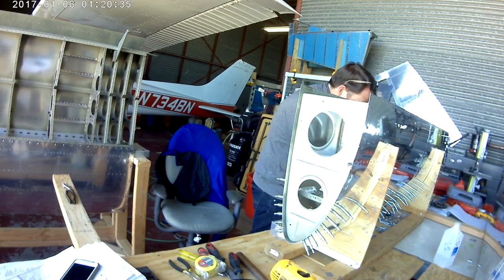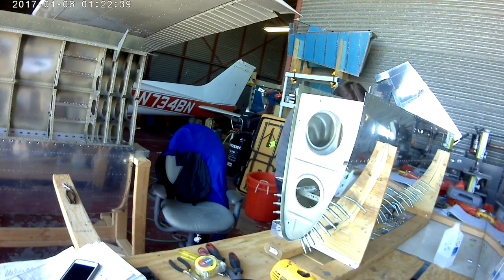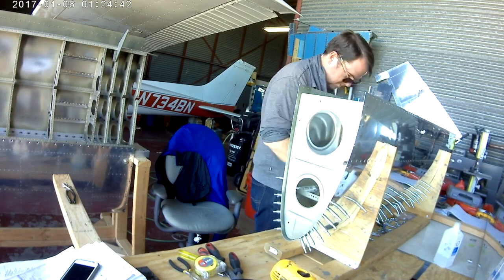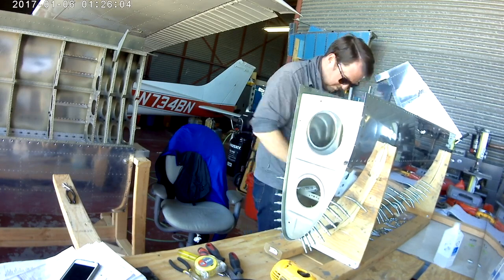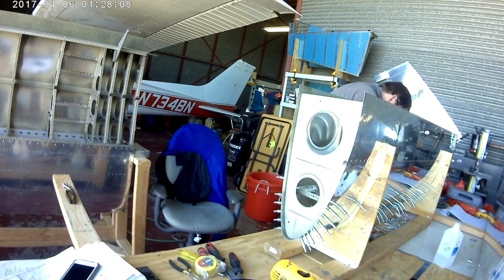Well, that's great. Other thing is, make sure your mushroom set on your rivet gun is flush. It's not as easy when you're working by yourself, so you have to be very vigilant, because you don't want to leave any scars or things that you're going to have to fill with Bondo later. Which I think I've already left one, but, you know, big deal. Anyway, just riveting away, and I'm going to be finishing that up today, hopefully, and then hopefully up onto the wing, so I'll see you soon.